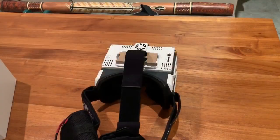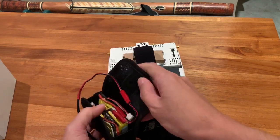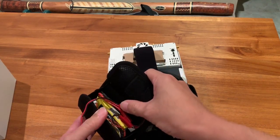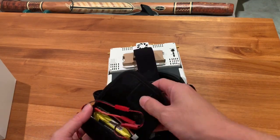The other thing I have added is this key holder here, which I use as a LiPo holder. Inside you can see two 2S LiPo packs that are connected in parallel, so that I have enough current to drive the goggles.